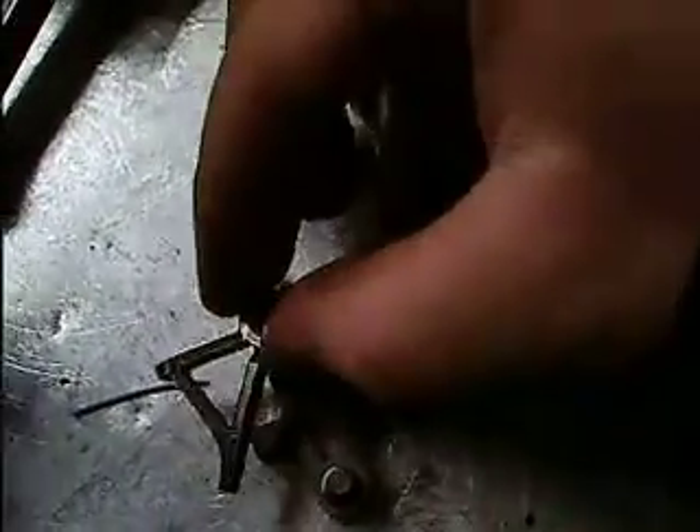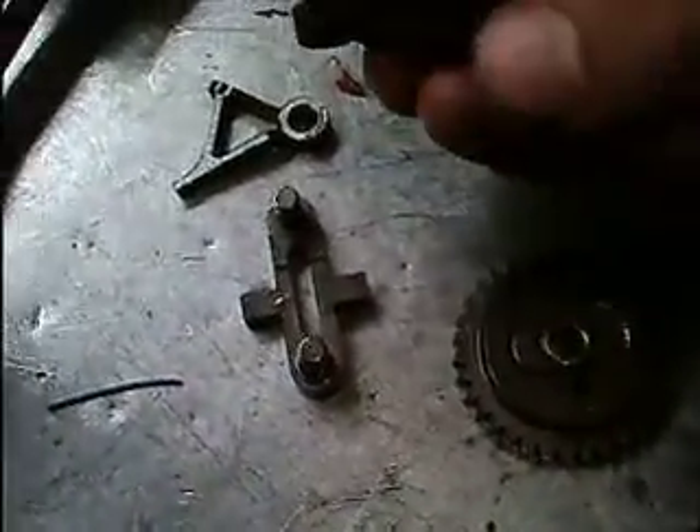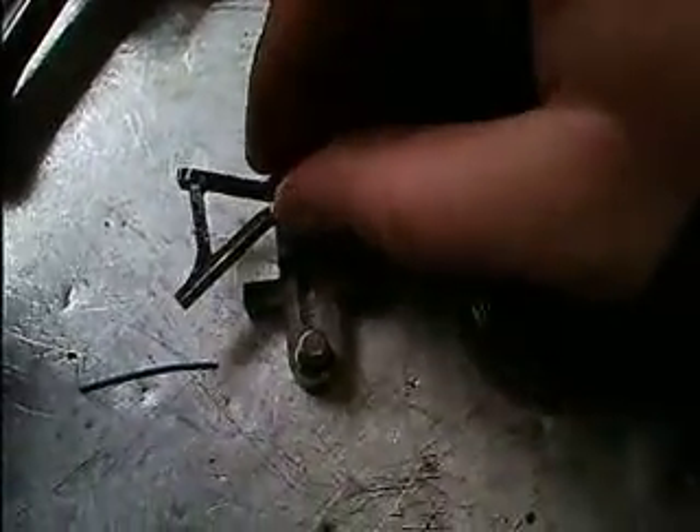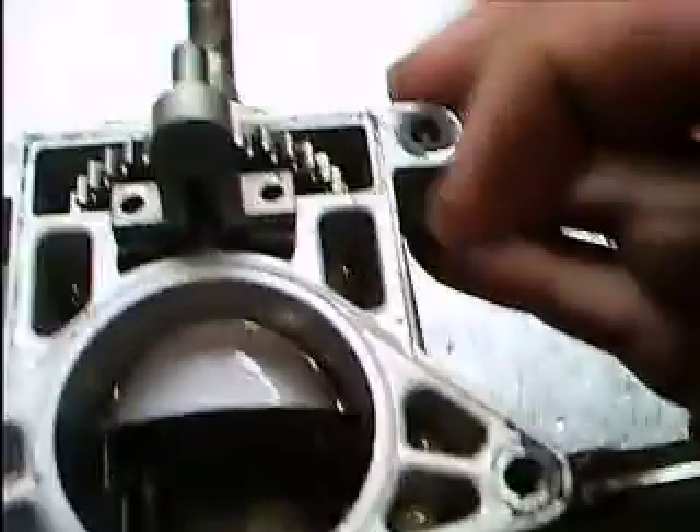Let's put it back together. Do I have it backwards? I do. Now I can't figure out how to get them on. The cam gear sits there, and that just has this little pedestal here and screws right in like that — two screws there and there. As it turns, these little arms here ride the cam and just push the rods up and down.